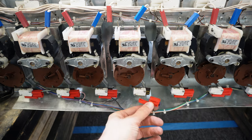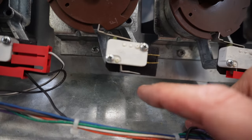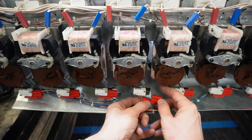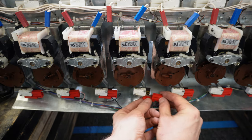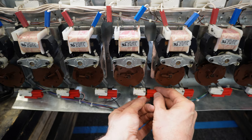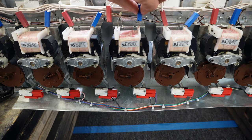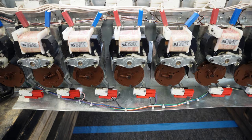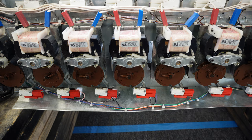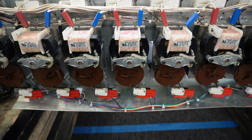Now reconnect the boot to the home switch. Don't forget the common pin which is offset at the bottom — that wire is actually used in the machine. Slide that on. Then attach the two wires that get pushed on to the motor. That motor is now back and that column can go back into operation. I hope that helps — this gives you an idea of how to remove the motor to replace it or to remove the cradle, and will get you started in the right direction.